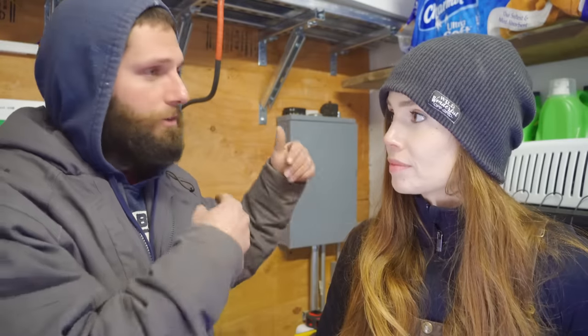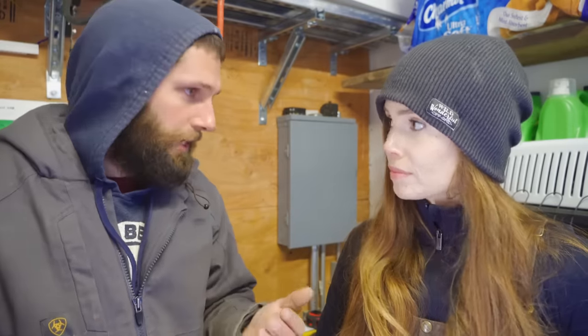This is a backup emergency system in case we ever run into a problem. If we're getting numerous days of snow, we're going to have a ton of snow and the panels are covered. We'll pull the snow off and if there's a layer of ice it's not going to charge very well. We've had that issue this year and last year a little bit too. So if we deplete our batteries, that thing kicks on. We run off the generator, it charges our batteries. When the batteries get up to charge, the generator turns off and we're operating on batteries again.